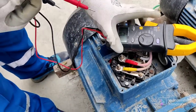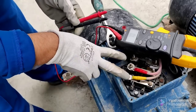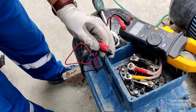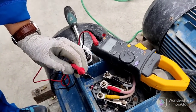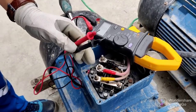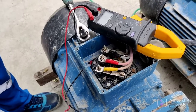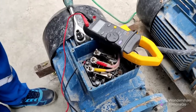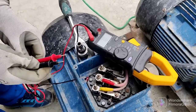How will we know the motor rotation is correct? First, connect the normal winding to the terminal box. Start and run the motor for about five seconds. If the water is coming out with full pressure, it means it's positive rotation and the connection is correct. If the rotation is opposite, the flow of water will be low — the pressure will be low — meaning the motor is in reverse direction and not properly connected. In that case, just change any two wires.